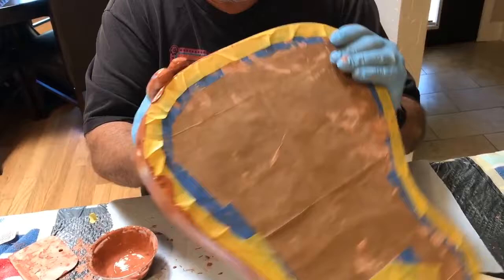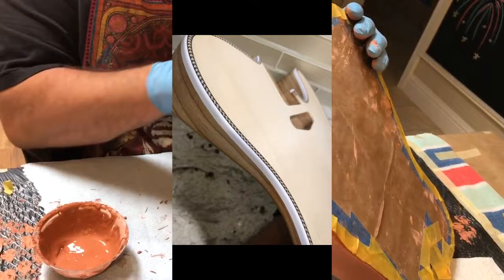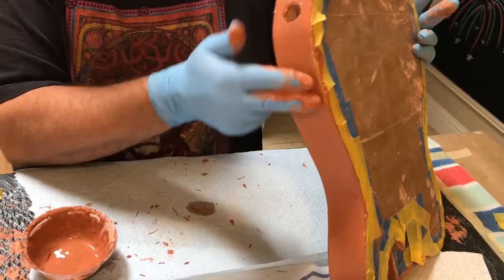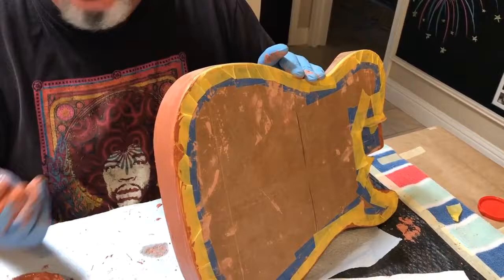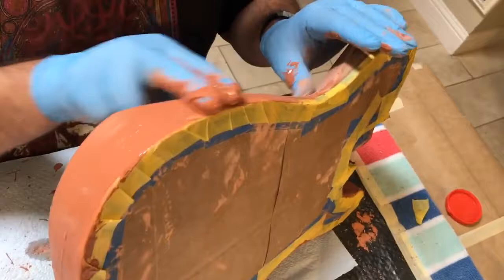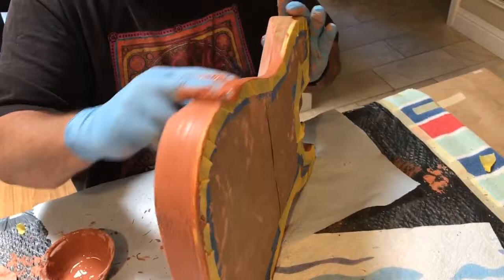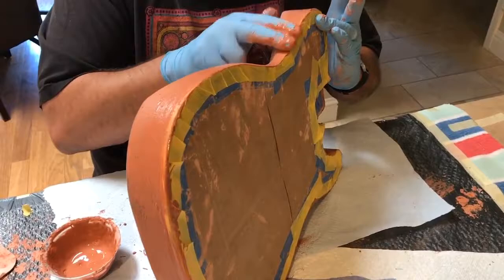I actually have a really cool binding. I had a local guy put some herringbone with a white purfling on the outside — it's double binding and it's really cool. Bending that purfling is tough, but there was a video I found where they cut the black plastic border for the herringbone, and if you slice it off, then it bends like a shoelace and you can just glue the parts back together after you bend them into place. He said he did that and it worked like a charm — around the horns he cut it on both sides, and in other places with less severe turns, he just cut it on one side. He did a beautiful job; I was super pleased.